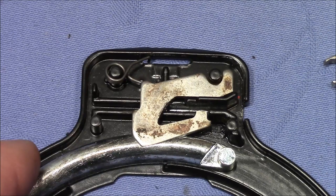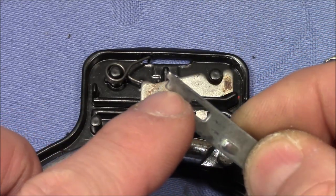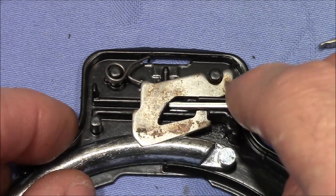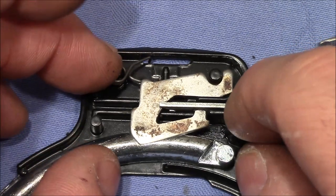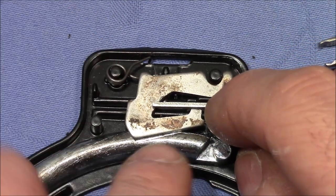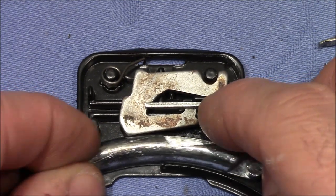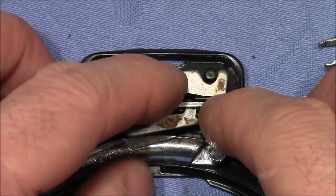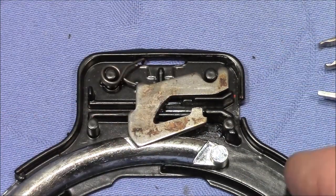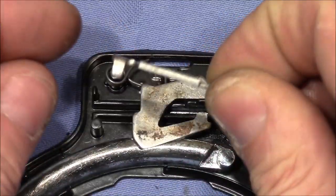When we use the key, this second step here interfaces with the plate and pushes the plate up because of this slope — because of this angle cut — and then the bolt or the ring can slide through and free the room for the wheel. But there's a little bit more security because of this plate here.